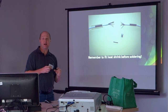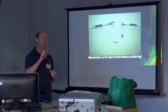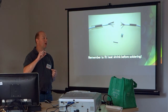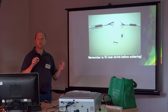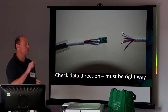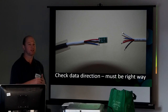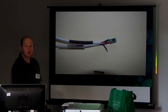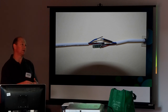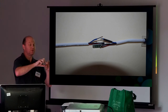The reason I use three pieces of heat shrink — and sometimes five — is that the 12mm clear heat shrink doesn't shrink down tight onto the alarm cable, so I slide on two bits of 10mm or 8mm depending on what I've got handy. Solder on your little board, making sure you get the direction right. Pixels have a data in and a data out, so make sure you solder the board the right way, otherwise your null pixel is not going to work. The wires are joined with the pixel sandwiched in between, and you fold it back to get it in line, nice and smooth.